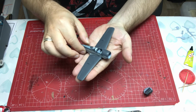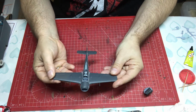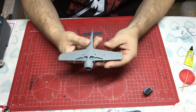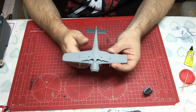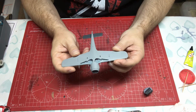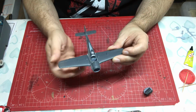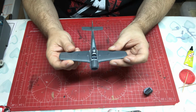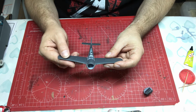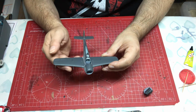So my second coat of the dark grey is now dry, and you can see how the second coat of paint really makes a difference to the overall finish. All the patchiness and brush strokes that were there after the first coat of paint have gone away. Now if you feel that there is still a little bit of patchiness and you want to do a third coat, that's quite alright. Just make your third coat a little bit thinner again than the second coat, and that should even things out nicely. You shouldn't need more than three coats.